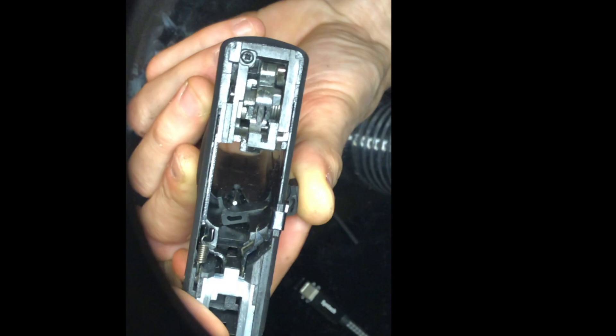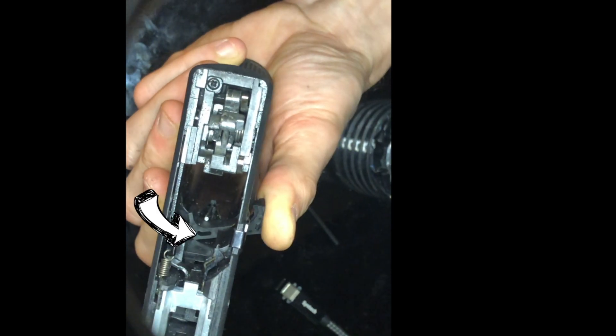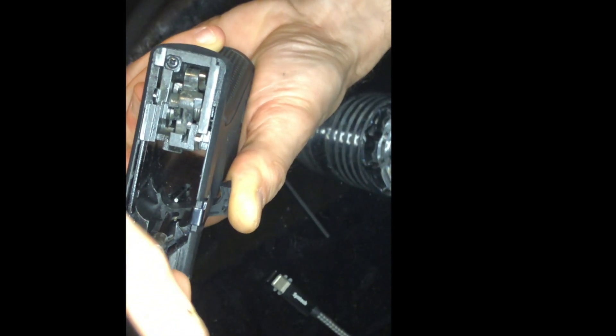Putting it back in: pull the pin towards the rear and slip the thin corner of the button under the pin. Then you'll need to get more leverage — stick the small flathead in the slot of the button and push the button towards the hammer assembly, all while simultaneously gently pushing the mag release button in from the side.